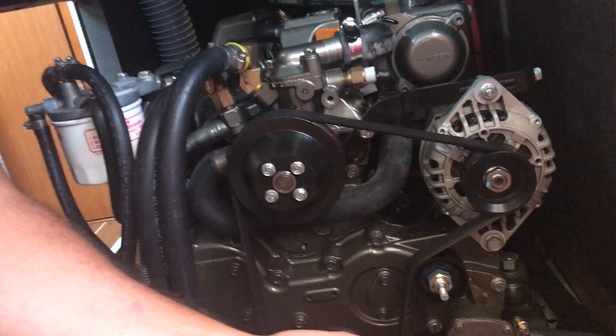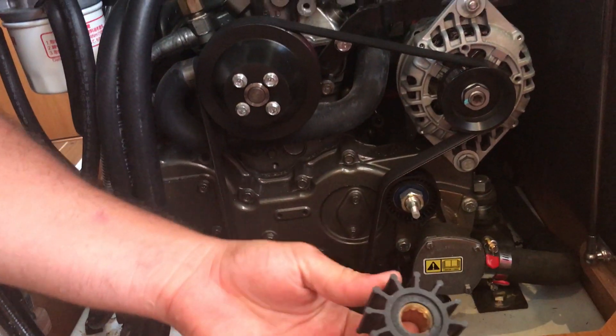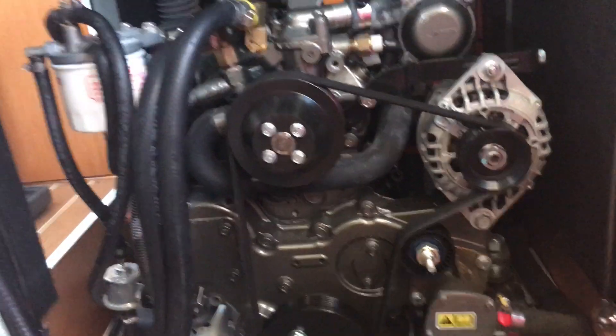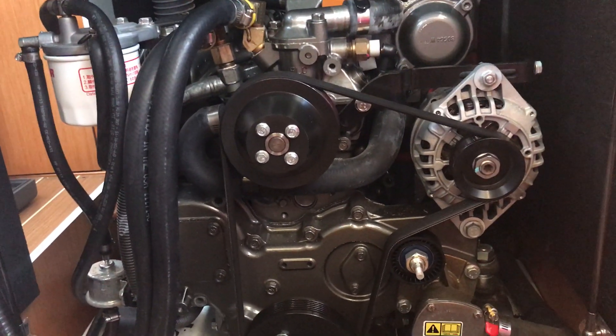The objective is to try to rebuild your impeller, because if you can get all the pieces to rebuild it, then you know you got them all out. If you're missing like one blade, that means there's still one blade somewhere inside your engine. You want to try to get that out because it will come back to bite you later and your engine will start to overheat.